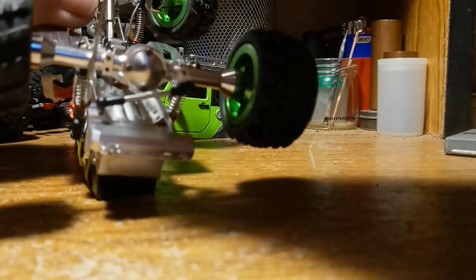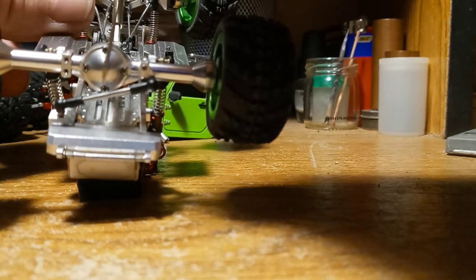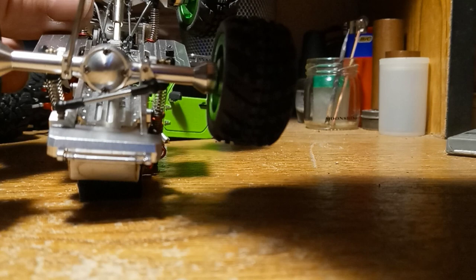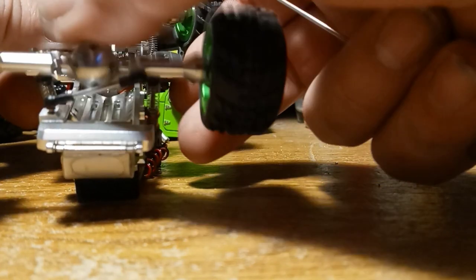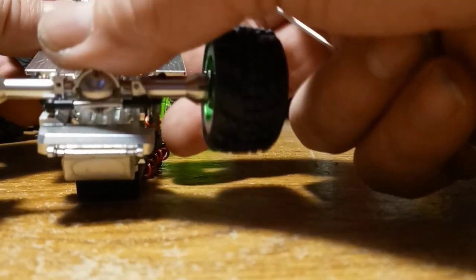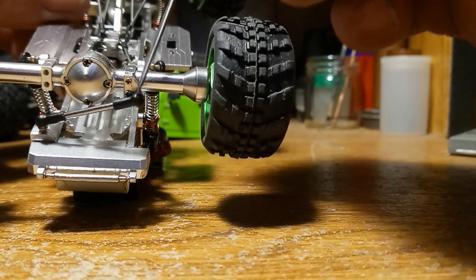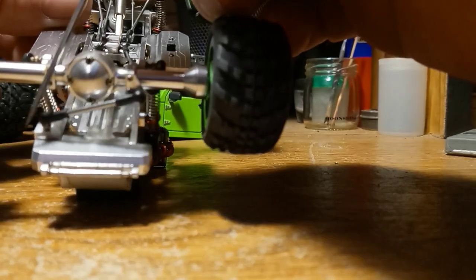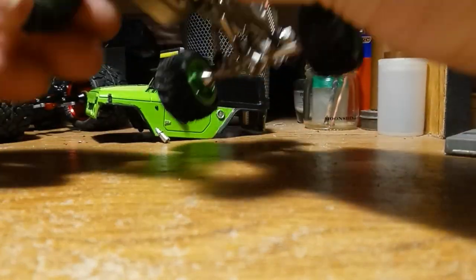This was the complicated one to make. I don't know where this link right here came from - it's thicker and threaded on both ends, fits perfectly into the GK24 ball ends, and they do work on the Orlandu ball screws. It's just a little more tensile strength - the Orlandu link ball links' little plastic pieces seem a little looser than these. I wanted a little more ball screw protection on the back since it's exposed with no guard, and that'll protect those Allen head screws.